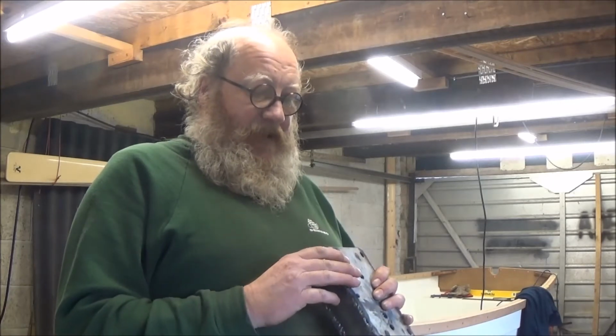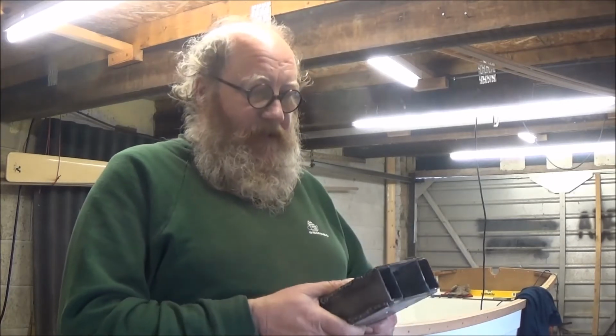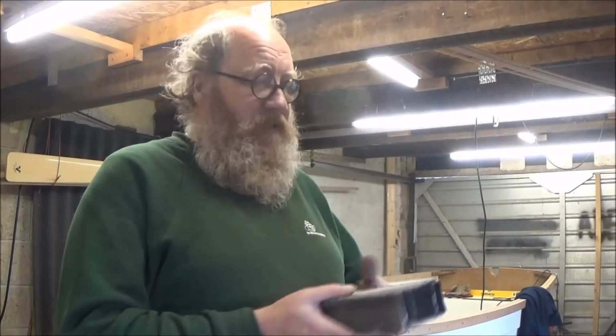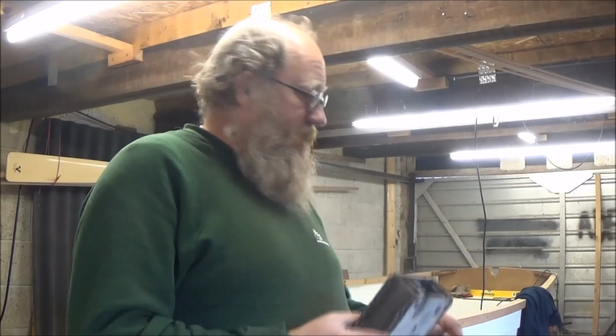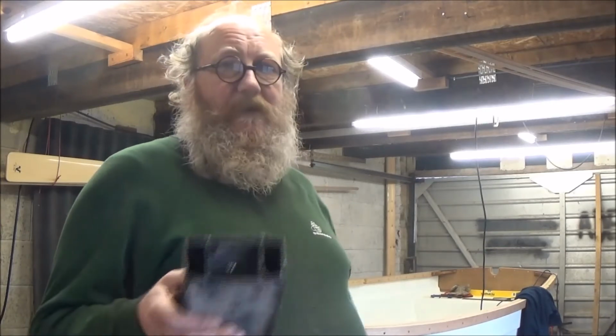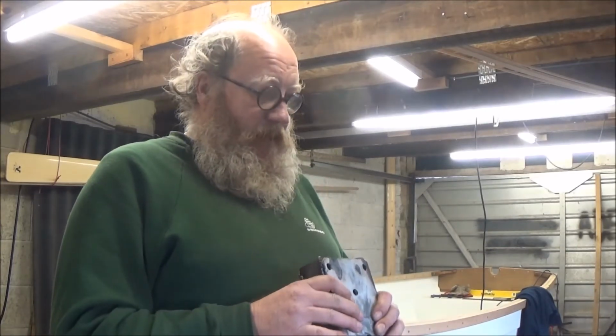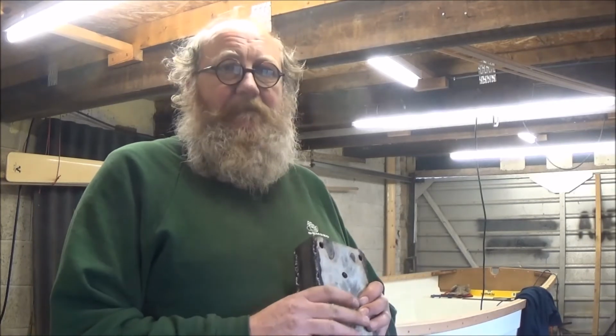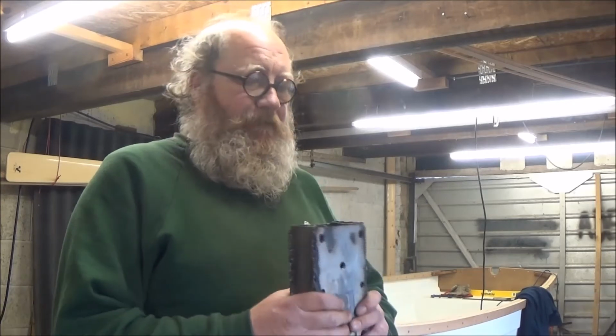As I say, I didn't really want to start getting involved in running out a dedicated 30 amp socket outlet, which would be one of those big red plastic ones, for the welder, because I can't move it anywhere. Then it's going to be tied to one place, and it doesn't come with a great big long extension, and I certainly don't want to be putting a load of extra cable on it just for the sake of that, because of where you're going to store it all.